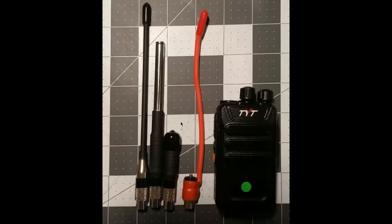The UHF stubby duck is center-tuned to 465 megahertz, which corresponds to the midpoint between FRS and GMRS frequencies in UHF, along with the UHF counterpoise adapter. We're going to do a little field test of these along my benchmark route along the Spray River, and after that we'll have a quick look at what the counterpoise profile looks like on a vector network analyzer test.